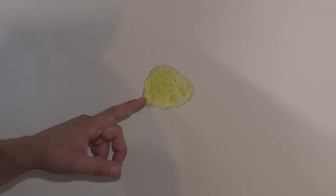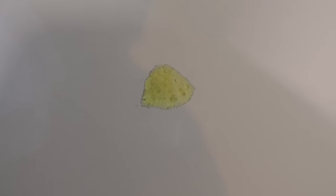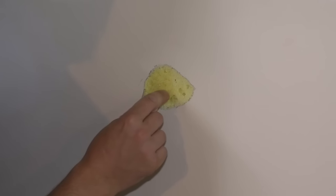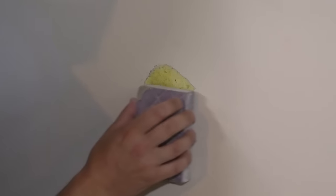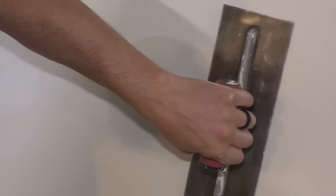And the idea with this is the spray foam is gonna stick to the drywall, and now my mud will actually go over this, and hopefully it will stick to the spray foam, which is stuck to this, which will make this a decent repair. I don't know. We're gonna try it. All right, that's all I'm gonna do for a first coat. You can see some spray foam sticking out here, but I wonder if I could sand that off afterwards.